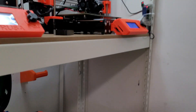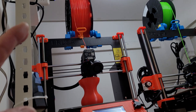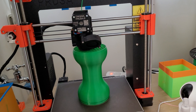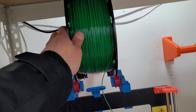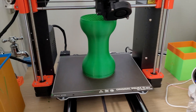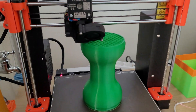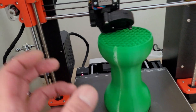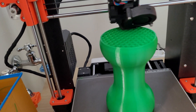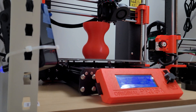I'm actually printing a fan shroud for my Ender in ABS to fix some problems. As far as the three kilo spools, those have been working really well with my ball bearing. I'm going back to 8mm³ per second for max volumetric rate. This is all TPU material, and I'm getting super good quality. Bigger nozzles just aren't worth it — you lose quality, you get a lot of stringing, and you lose that uniform structural integrity of the infills because your lines become thicker.